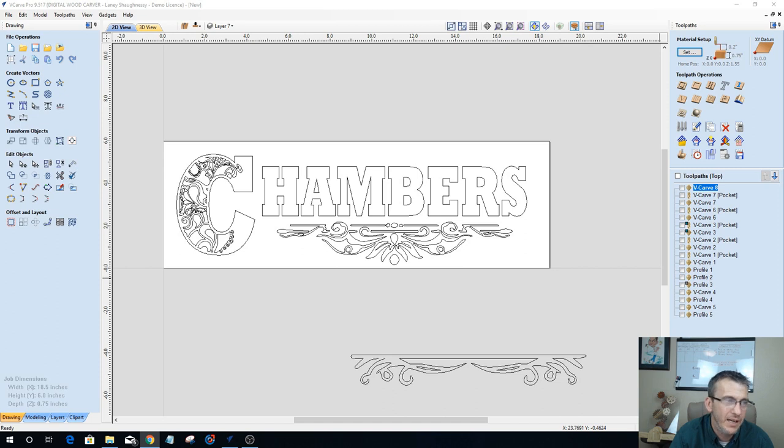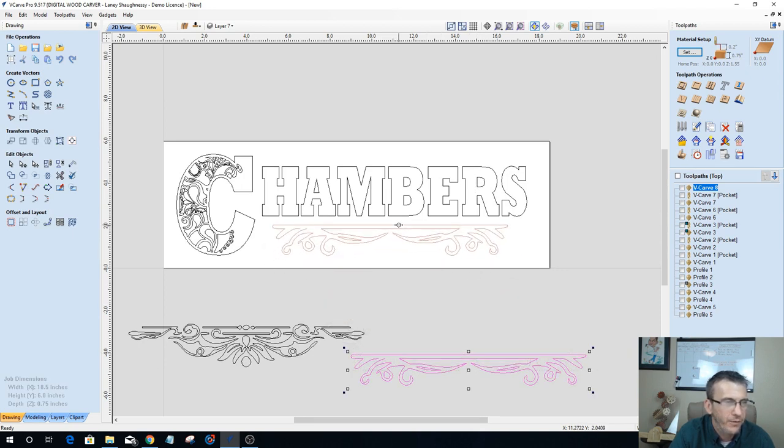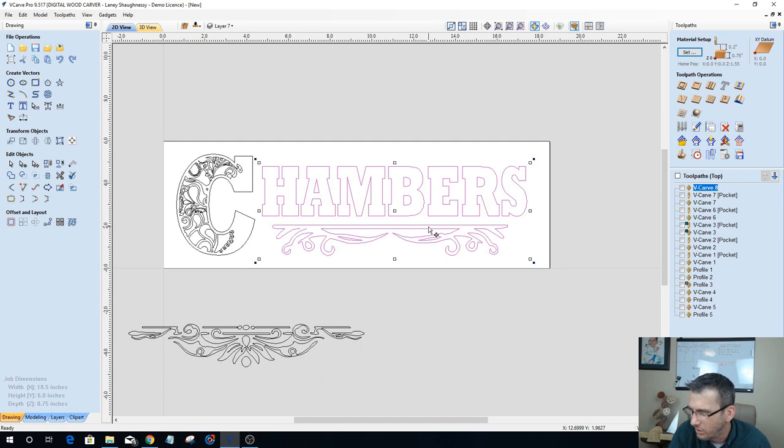The better cut and everything, in my opinion, would be using the flat depth on this versus the regular V carve, because of the size and everything, the flat letters with an end mill for the flat area clearance tool, doing that 2 minute tool change to cut out 30 minutes. But it all depends, some people like that full V on those larger letters. I love the full V, no flat depth, for most V carves, but I do not care for it in larger letters, where it would look better flat instead of so deep. I don't want it so deep that it's a pain.